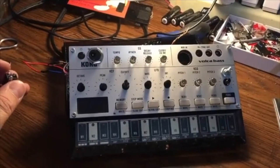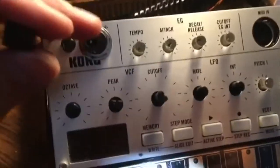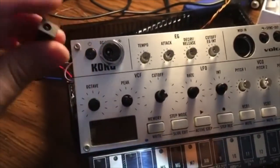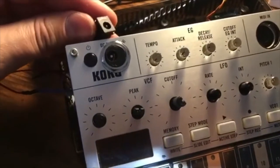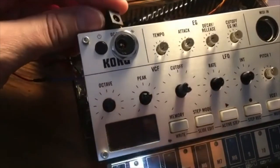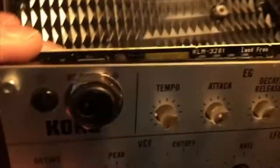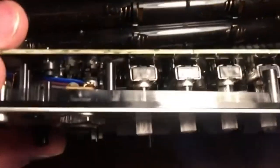The Volca Bass is under the knife again. This time it's because I wanted a standard Boss barrel jack for power, and it's the opposite polarity of this tiny one it came with that only a couple other Korg things use. I want all my 9-volt stuff to use the same plug as all my other 9-volt stuff, like all my Boss pedal stuff — even if it's not Boss, it uses the same thing.